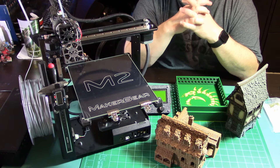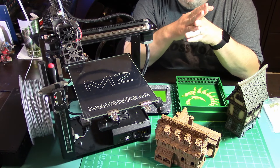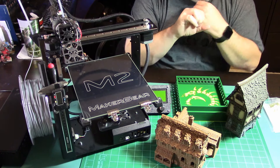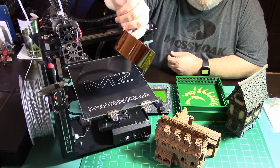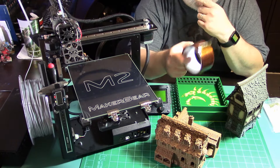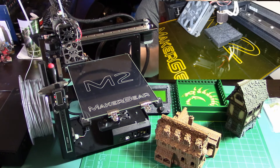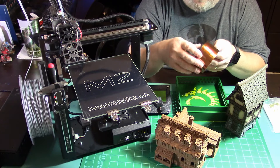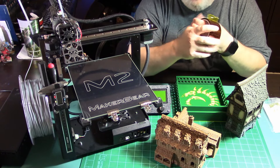The print bed comes with a glass plate - I would recommend getting a second one, especially for printing PLA. When I started with it, you're going to get a roll of Kapton tape. This came with the printer - but putting it on the glass plate so it's smooth with no gaps and no air bubbles is an exercise in frustration. I did my first few plates with it on there, it worked okay. I had a little bit of curling on the edge of my prints, so I tried buying some full sheets to cover the glass - that was also a pain to put on.